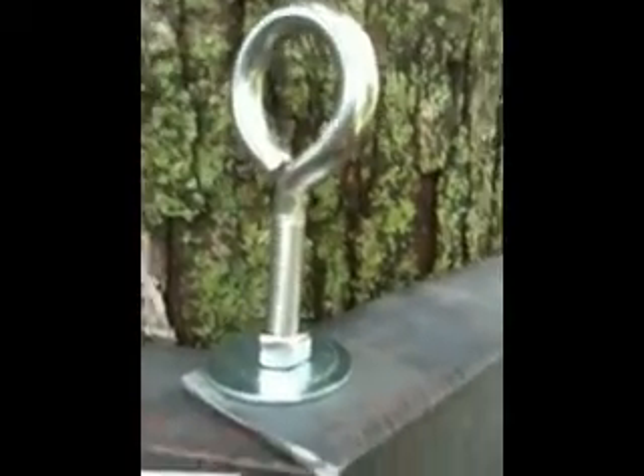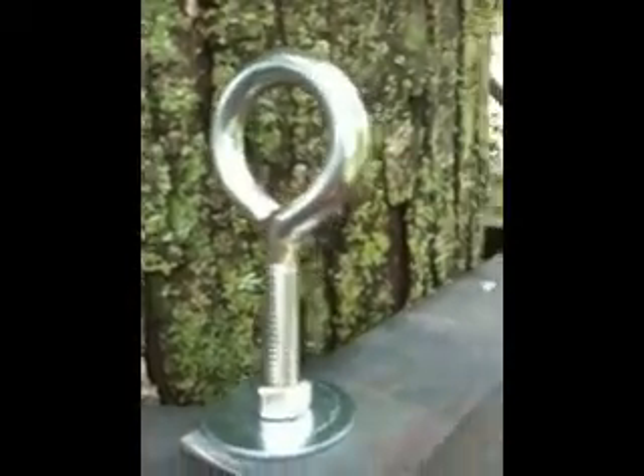I'm currently sitting halfway up a tree getting the tree house into place. What I've done is cut six 12-inch sections of 2x2x1/8-inch steel and made a hexagon pattern around the tree. I have a nice eye bolt with a tensile strength of 400 pounds, giving me up to 2400 pounds of weight capacity for the tree house. You can see I'm 10 feet up a ladder.